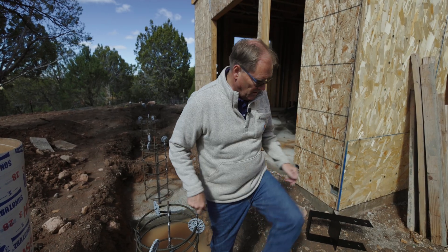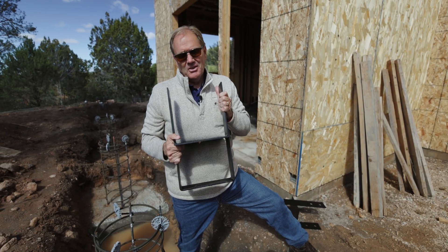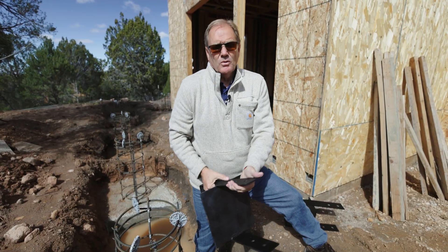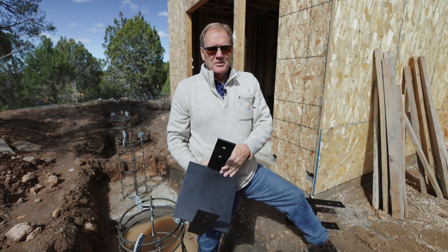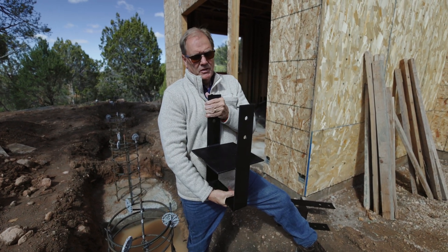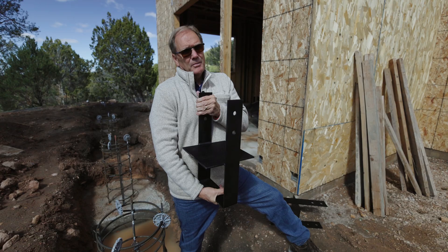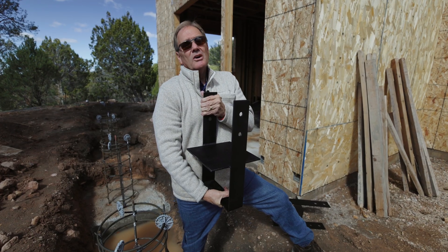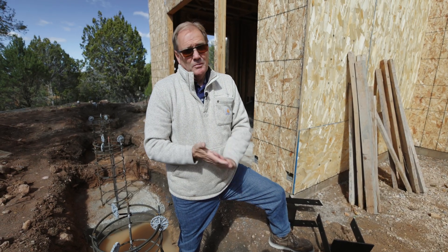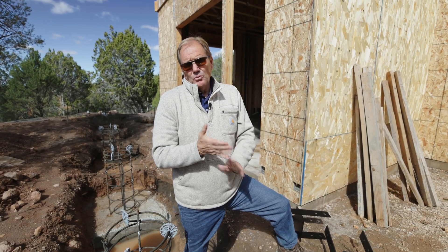It's going to be even more complicated over there, because this one here is for a 10-by-10 rough sawn timber. This one's going to go just behind where Caden — my photographer, my son — is standing. With my framer here, we'll actually line this perfectly, because this is going to go up 24 feet to support a column that high up, and it's actually supporting a roof all the way up that height. So having your framer here, if he's cooperative — and mine is, he's phenomenal, thank you Cody — we'll get all that set up so that it works out just fine.